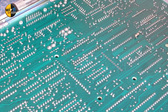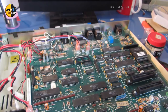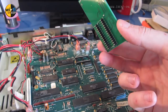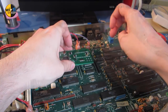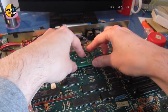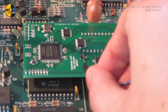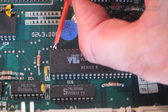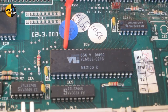Nearly done - that's the last pin done right there. Finally, we just need to clear off the flux, which is actually electrically conductive, so we need to have that removed. Now it's time to install the new ULA or NULA board. We take the protective foam off the back and you see the pins - it's important to get this the correct way around, so it's going to slot into the socket like so, and just the final push down right there. The final part of the installation is to attach the additional GPIO pin or loop cable, and that goes in this socket and on to the fourth pin of IC6, and it just couples on like that.